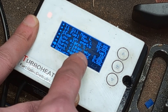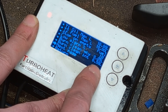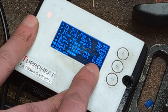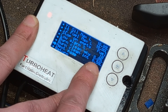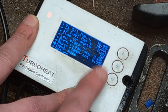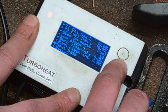280 seconds — that's about four minutes — so it runs for four minutes on preheat for me. Setup takes you into the rest of the menus, and if you press it once more that lets you run a clean cycle manually, but you can set it to do it automatically. The burn clean is the clever bit: I've got it set to half a litre, so every half a litre of waste oil it'll swap back to diesel for 50 millilitres. I think it comes factory set after two litres of waste oil to run about 500 millilitres of diesel through just to continuously clean it, so hopefully you get a longer burn without having to take it apart.